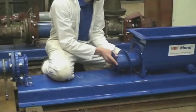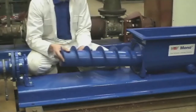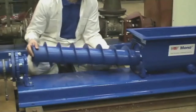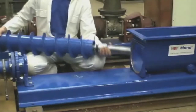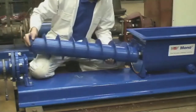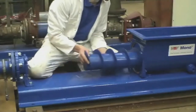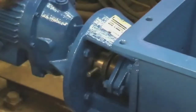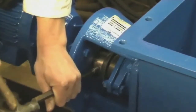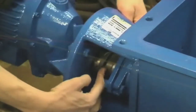It should be noted that, dependent on the pump size, suitable lifting equipment will be required to lift the screw conveyor away from the pump. Reassembly of the screw conveyor is just as simple. The conveyor is lifted back into the hopper, pushed into position, the shaft aligned and the drive shaft pin replaced. The thrower can then be pulled back into position.